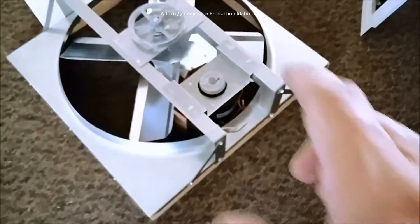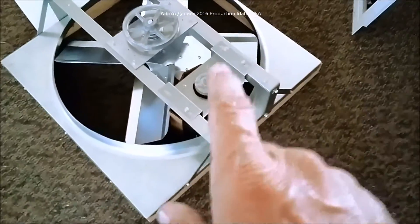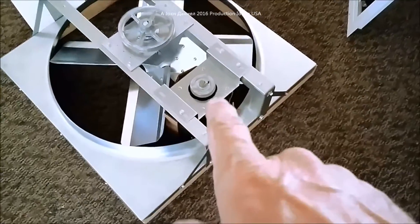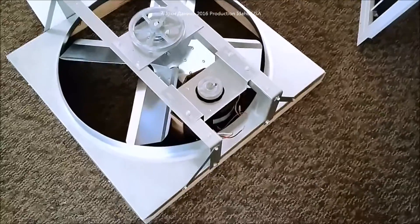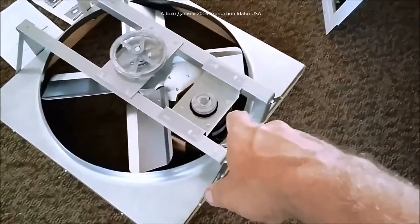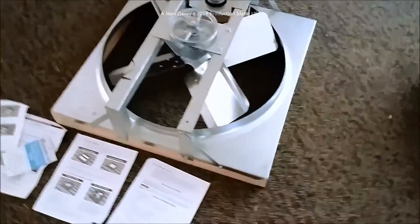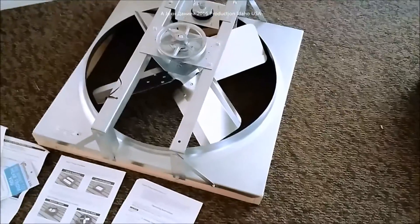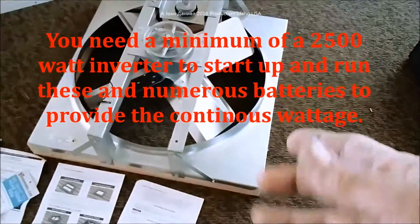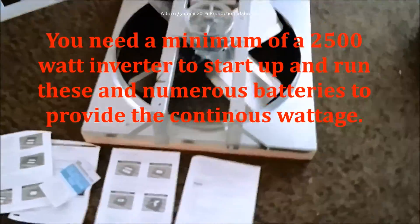You're going to need about 370 running watts. The maximum peak is nine times that — about 3200 watts — due to the capacitor on the motor. But the start will only last about half a second, then it calms down to about 1500 watts for the next four or five seconds, and then levels out at under 400 watts.